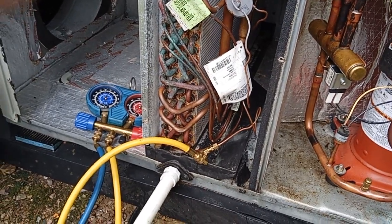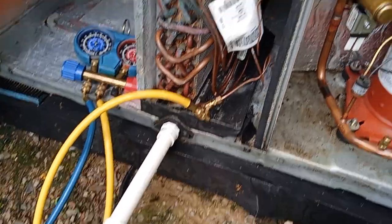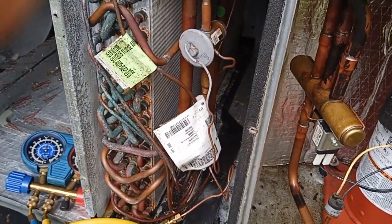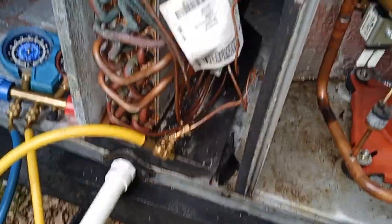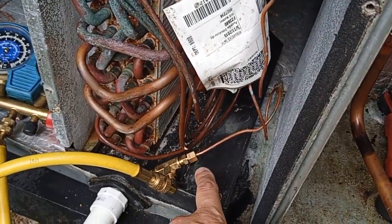Welcome to the Train Wreck Part 8. This wreck has many installations. The problem with this thermal expansion valve on the low side — there's an indoor coil, it's the evaporator — the capillary tube broke off at the bulb. What I've done is terminated that.